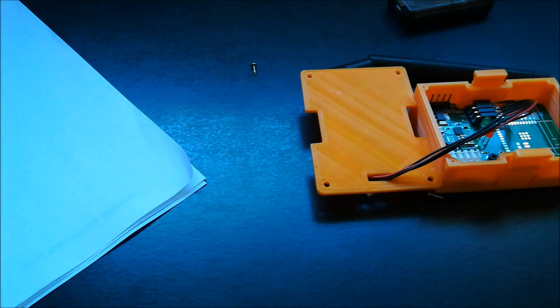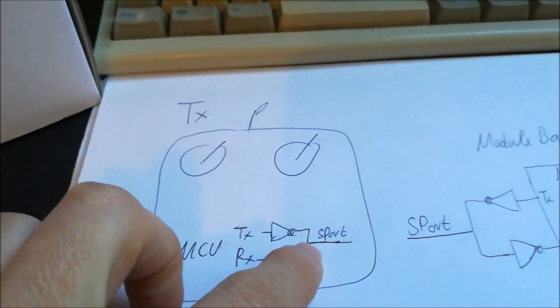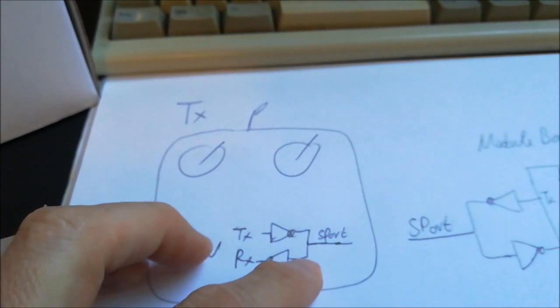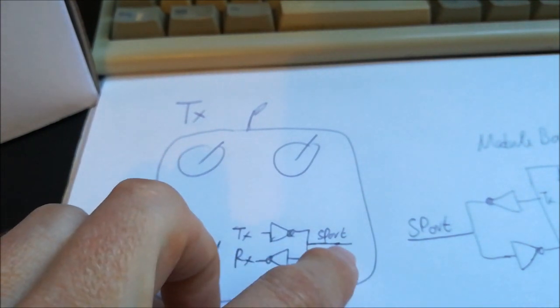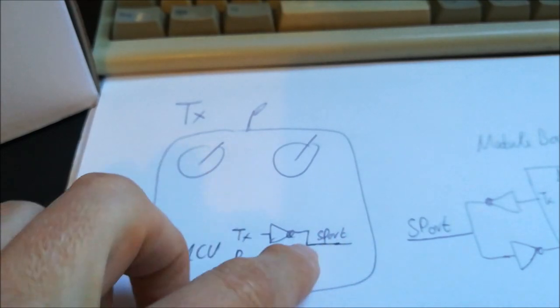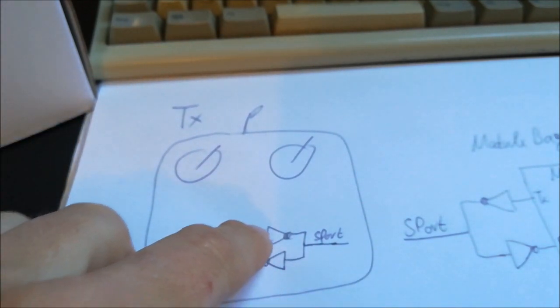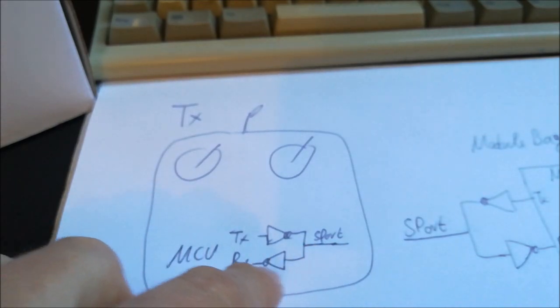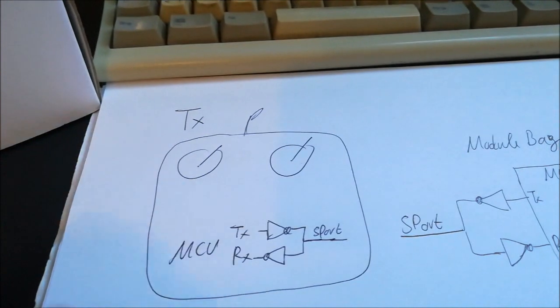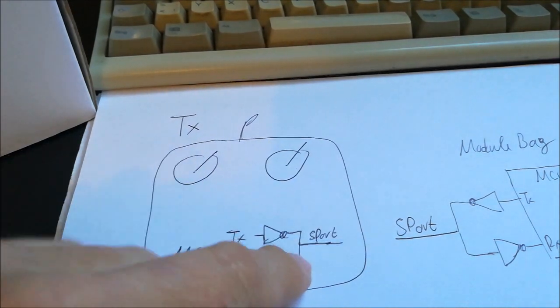And the reason why you need this is as follows. So here that's how it looked like. So this is your transmitter. And in the transmitter, on the TX module, you only have one pin. Now through this one pin, you have to establish a bidirectional full MAVLink communication. That is, through this one wire, one pin, data must flow out and must flow in. And that's why you need such a splicing unit, so that when you want to send in the out direction, you can go with the upper path, this transmitting path, and when you want to receive, you can go through the lower path, and you need to switch between these two options. So that's quite standard. And this piece of hardware is already found in your transmitter. So what you need, obviously, is a piece of hardware which kind of reverts this, namely this here. So please focus.